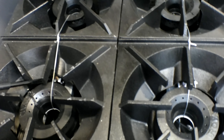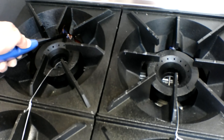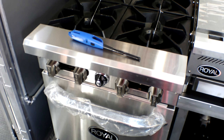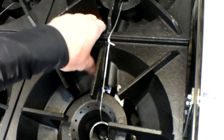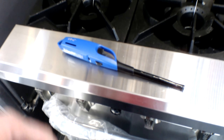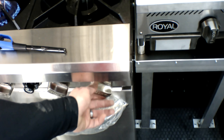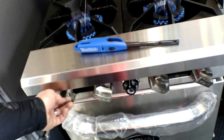Let's go ahead and fire the equipment up — you will need a lighter for lighting purposes. Each burner has its own pilot that is open; it is a very small amount of gas that comes through the system, so small that you will not hear it or smell it with the hood system on. You can see there's metal wire — we use bailing wire to strap the burners in place so that they do not bounce out during transport. Eventually this wire will break due to excessive heat; simply get some more bailing wire from your local hardware store and replace. That is how you properly light the burners. When you're finished, make sure that you turn the burners back to the off position.